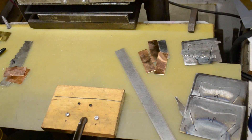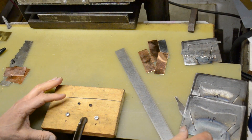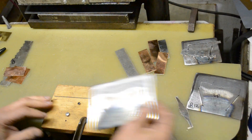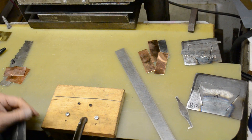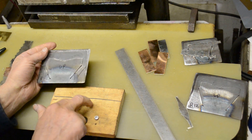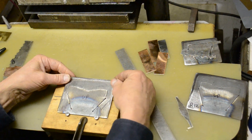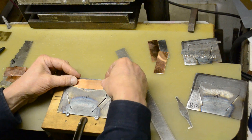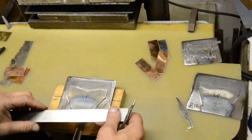More about side cutters, especially this little loading block, which will be of great help. The important things are the two pan head screws — they have a big underside so that the die will go under the lip of those two screws. Two other screws go up here so that when you push the outside part of the die down, it will effectively open the die up, making it much easier to load metal in there.